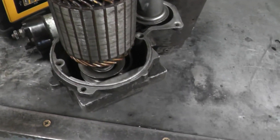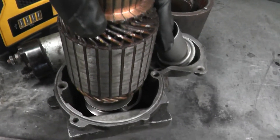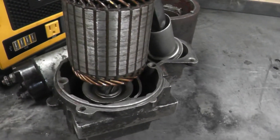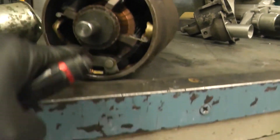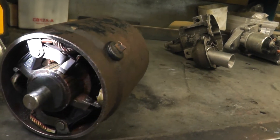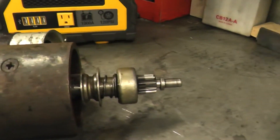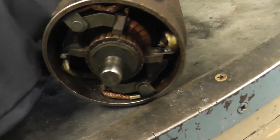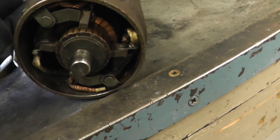Maybe you could see it better from this angle. There is a yoke — the yoke moves the drive in and out. This is how the brushes sit: you can see one, two, three, and four. This is how the brushes come and sit around the armature. The armature sits inside the housing. Because this armature will spin, the only way to get the current there is with the help of brushes.